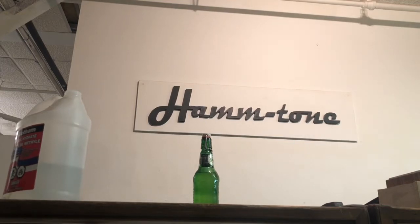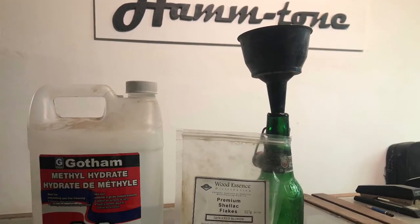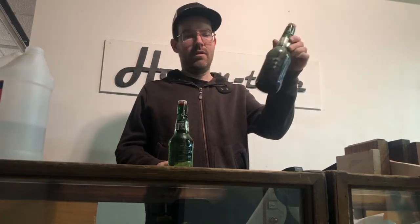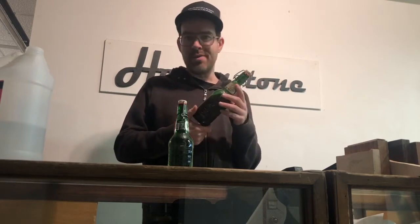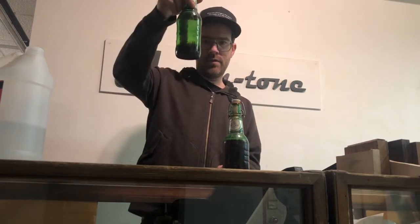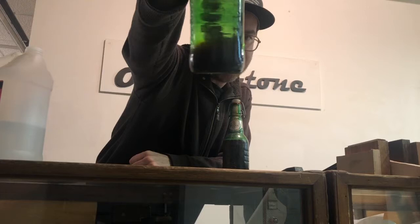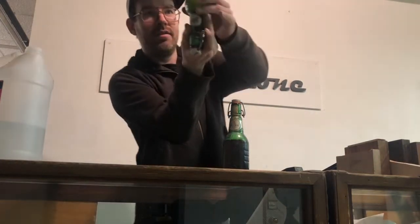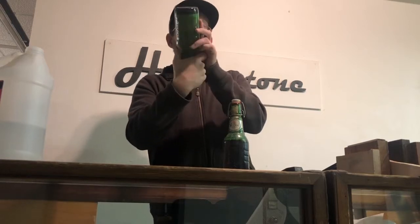And they will look like this. As you can see, it's nicely dissolved. This other bottle has been sitting around for a week or three. The shelf life of shellac is approximately six months; I usually use it within a month or two of mixing. This one is the one we just mixed — if you look closely, it's got a cloudy haze at the bottom, and if I tilt it sideways you can see some stuff that's already dissolved and some that's still gloppy.